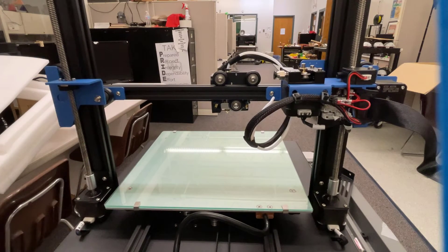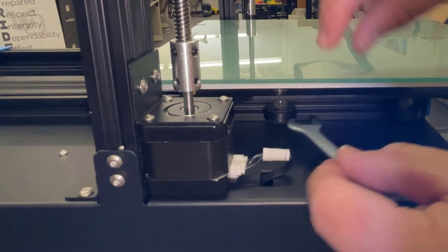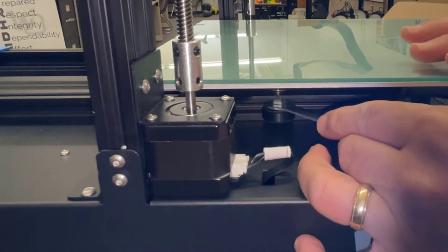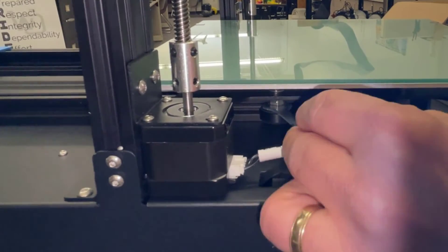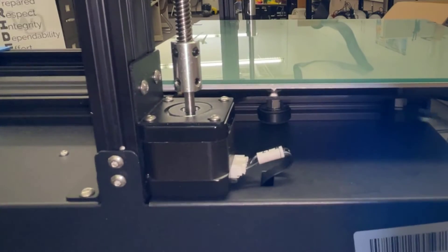Mine's got a little wobble, so I'm going to get under there and show you a view of me tightening it up. Here we are underneath — here are the little eccentric nuts, and you can just give them a quarter turn to see if you can get your bed the way you want. I'm going to go the other way on that — so that's a quarter and a quarter — and I like that, I'm going to work from there.